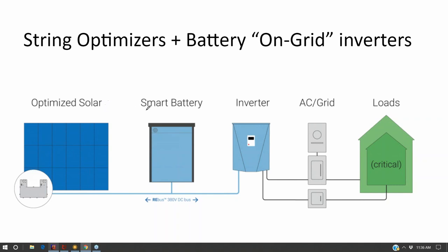And so what some inverter manufacturers are doing, this one's a US startup called Pika. What Pika says is, hey, we're putting a charge controller up on the rooftop. SolarEdge puts one behind every single panel. We're just going to put one behind a single circuit. And then we're going to have a little battery management system where we can just plug the battery into the circuit and keep on going down to our inverter. So their bus bar system is a lot more plug and play, whereas when I'm doing my bus bar systems, I'm buying a box and I'm custom building it inside of that box.